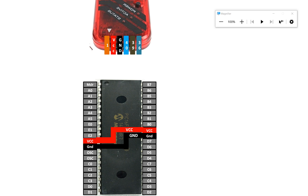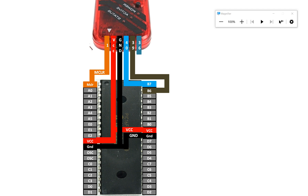Now let's connect the PICkit 3.5 to the microcontroller. Pin 1 of the PICkit (under the arrowhead) goes to pin 1 of the PIC16F877A — the MCLR pin. Pin 2 goes to the shorted VCC point (pins 11 and 32). Pin 3 is ground, connecting to pins 12 and 31. Pin 4 goes to pin 40, pin 5 goes to pin 39, and pin 6 goes to pin 36 of the PIC16F877A. You can make a PCB for this connection since the same pins are always needed to read and write.